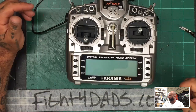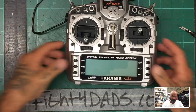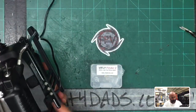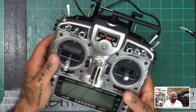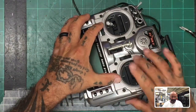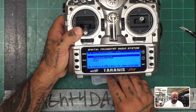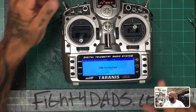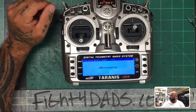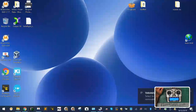So let's get started. I'm not going to get into installing OpenTX since I have videos on that already — I'll jump right in. I've got the Flysky box here so the USB cord isn't pressed too hard on the table. We're going to start by taking our trims, pushing them in toward each other, turning on the power, then letting everything go. We have an old bootloader so the firmware is pretty dated. I'll go ahead and plug in the USB, which will get us onto the computer screen.